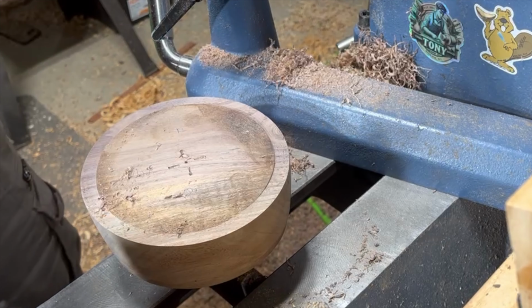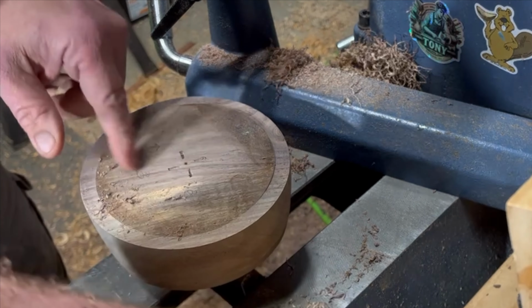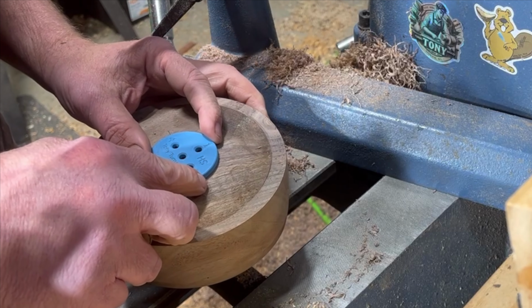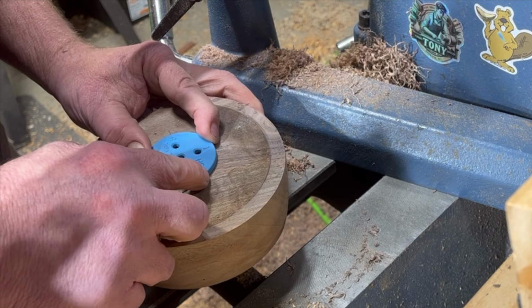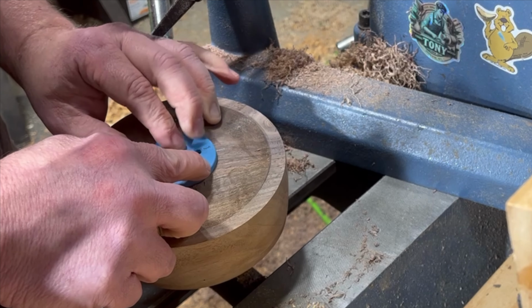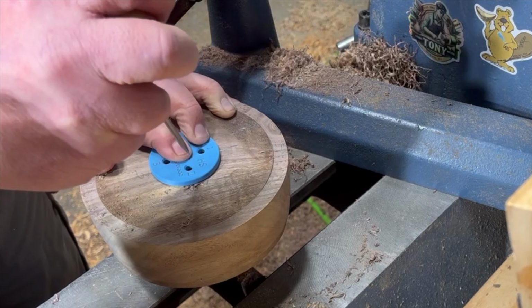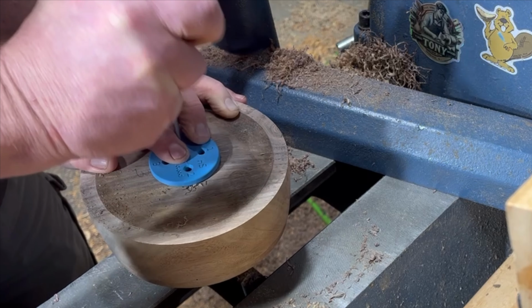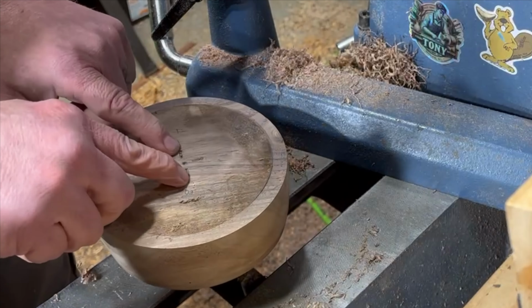So with that, I'll be able to line it up with the awl and make my indentations for our headstock. We're going to be chewing this up bad with the 4-prong, as you can imagine. So headstock is up on the 0. Got our 1, our 2. Just want to make sure we're lined up on that 1 and our line that we drew coming in from the other side so that we get a good match. And that's going to be number 1 hole, number 2 hole, number 3, and number 4. So just like doing a spiral box, this should, oh, they're right on the outside tips there. So we want to do number 1 to number 2.